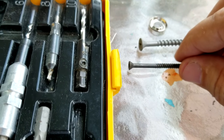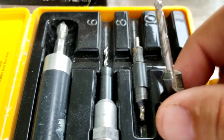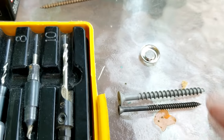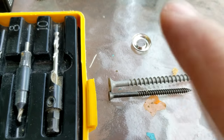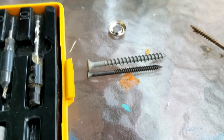Sometimes we'll still use this finishing screw along with these special countersink bits. These little drill bits are angled to drill a hole shaped for this type of head, so the head lays in there flat. You don't want the head chewing into the wood at the last minute and possibly causing a split or a crack when hanging cabinets — once you make that crack, that's it, you've ruined it.